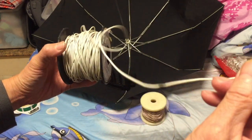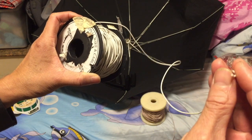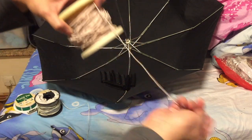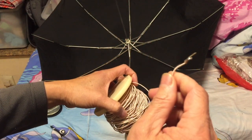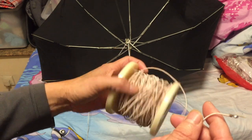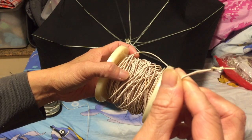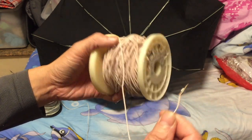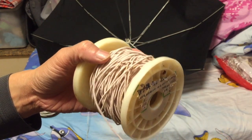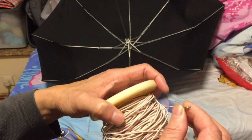You can use this type of 0.5 square millimeter wire, or you can use the Litz wire. The Litz wire is good for only AM radio reception. It's not good for short wave or FM, because it has multiple threads that are isolated and it will create a big capacitance, which is not good for FM or short wave at those high frequencies. But it's very, very good for medium wave and long wave.